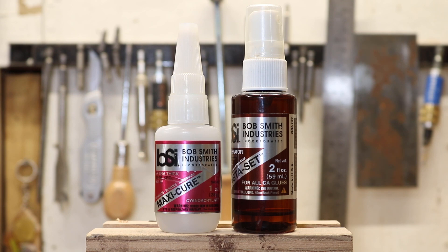CA glue is basically an elevated super glue. This can be used as a super glue — it will cure in about 25 seconds or so. If you need it to be instant, use this spray accelerator: put it on one side, put the glue on the other piece, put them together, and it's instantaneously bonded. That comes in handy if you've got something to hold and there's no good way to clamp them together.